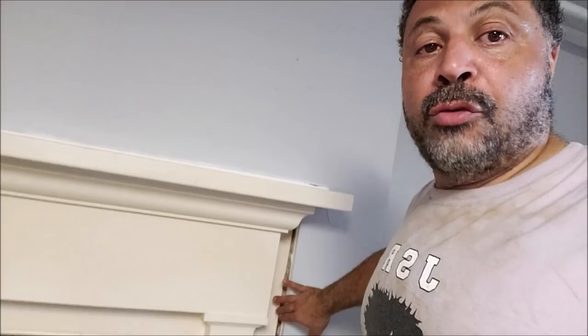All right, time to get this thing set. We got it in here. We got to come back because I, of course, like a big dummy, brought the wrong color paint. So I got to figure out which one's the right color, so we can touch up our screw holes and things in here. But it's solid. It's not coming off the wall here. So we're looking pretty good. One other thing we're going to have to do is make a little cove molding to go over here on the ends, and that'll tie it in there. And the next time we come back, we'll be working on the door frames.